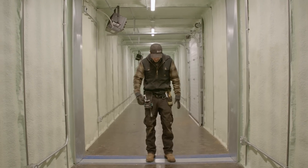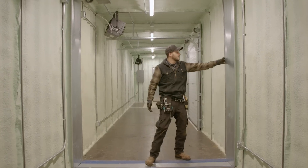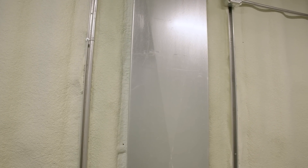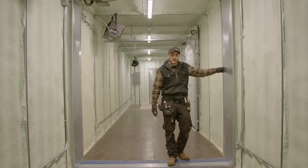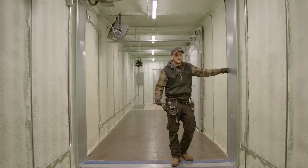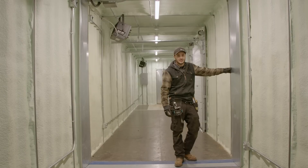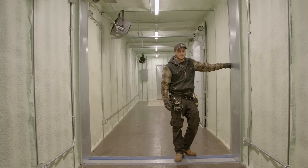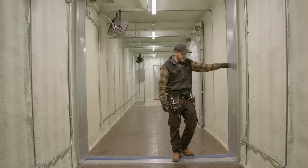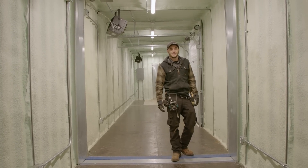Down here, we have our bottom threshold plate that spans the gap between the footers of each door — these are the door ends of the cans connected. We're able to get the interior flashing kit to fit nicely on both the sides and the ceiling. It's all tacked up in place, giving you an idea of how this is going to finally look, without just the final step of silicone they'll do at site. We're happy with how the prototype came together. We've got a few revisions to make, but I think this gets pretty much ready to sell. Keep track of our website, tcg.ca — in our modification components section, we'll have specific flashing kits and framing kits available to purchase for anyone looking to build an extremely long container like this.